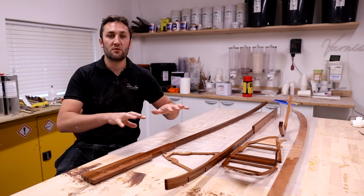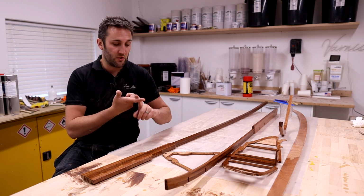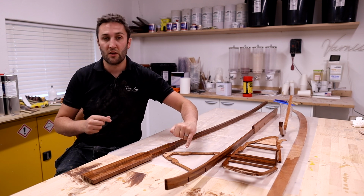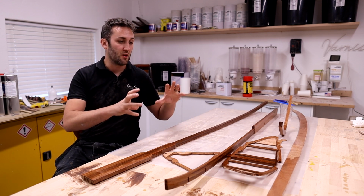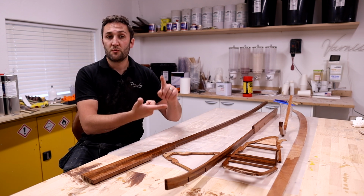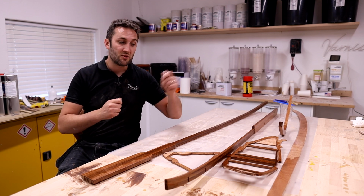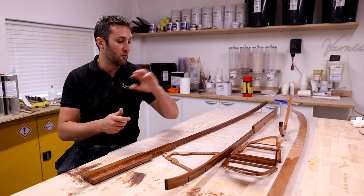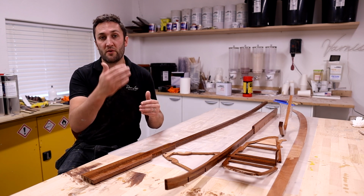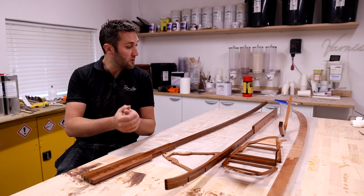What we want to do here is to do 3 coats on everything, and there are a couple of reasons for that. Firstly, the first coat is going to start to absorb in a fair amount, particularly in plywood, which is quite an absorbent timber in comparison to solid wood. Secondly, for coverage, we want to make sure that we've definitely covered every face completely. So if you've missed tiny little bits on one coat, you'll catch them on the next coat. The chance of you completely missing something for 3 consecutive coats in a row, hopefully is quite slim if you're pretty thorough with the way you're working.